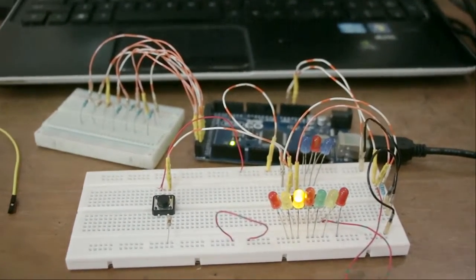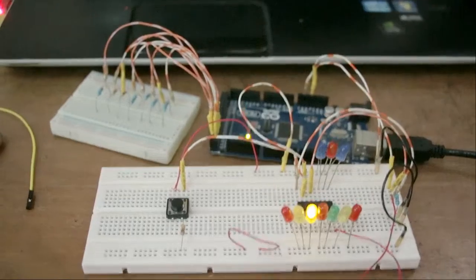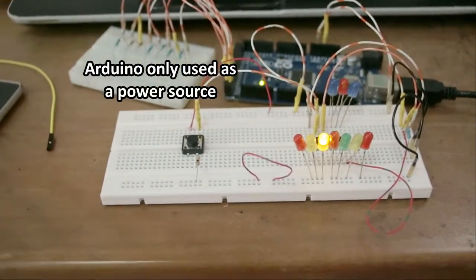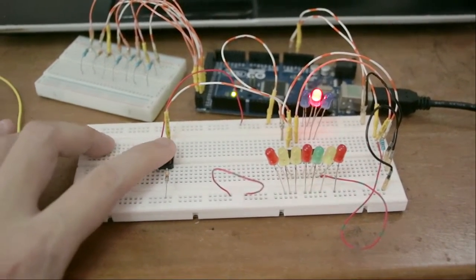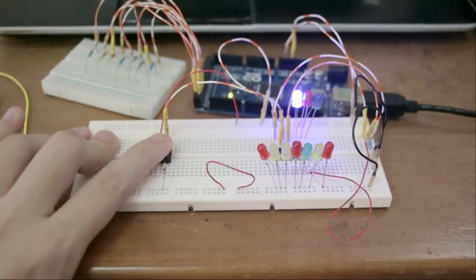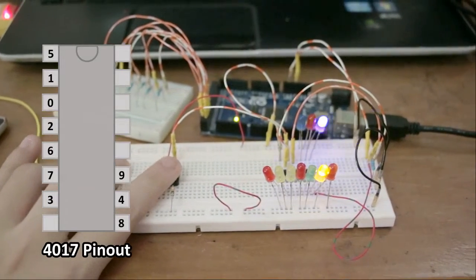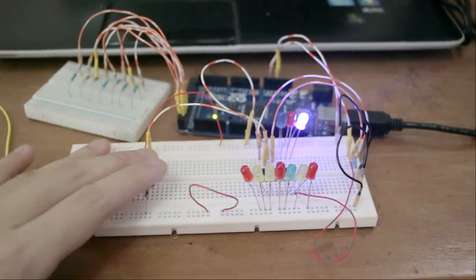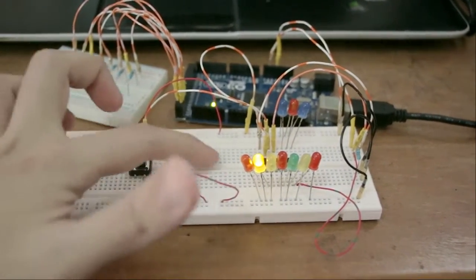This is my decade counter setup. I have everything connected accordingly - the chip in the center with all the pins wired up, but none of them coming from the Arduino itself. The only thing I can control is this switch right here, which controls the clock going to the chip. Every button press will forward the internal state of the counter. The outputs are all over the place - that's just how the schematic is designed - but the point is by using just one input you are able to move an internal state that will influence the output on the chip itself.